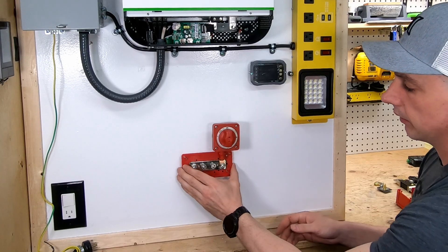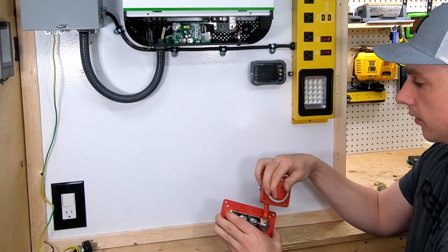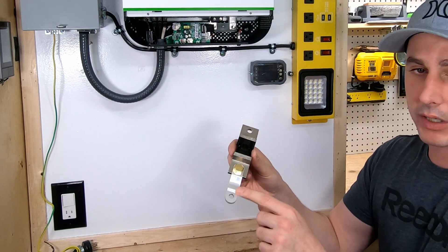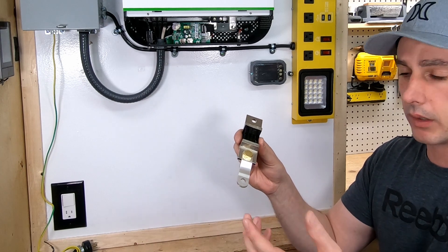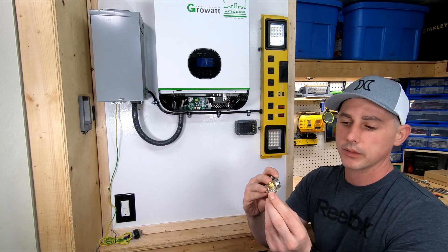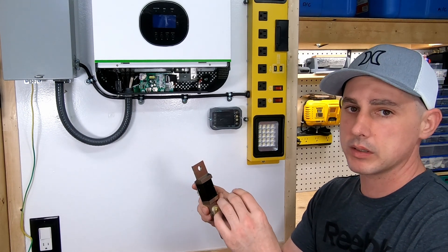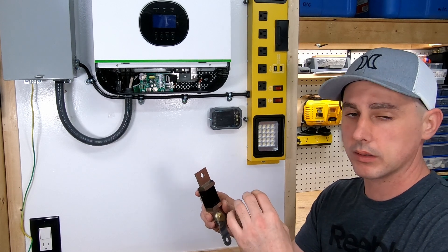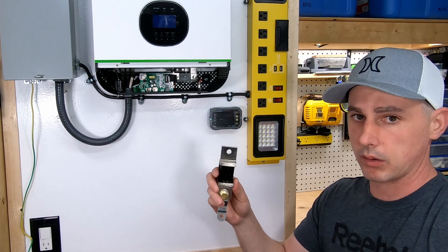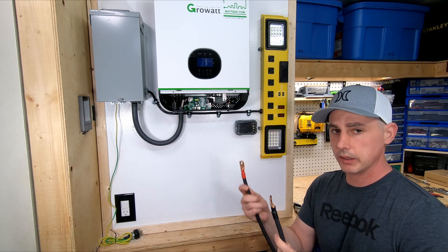This is going to be my main disconnect — it's going to get mounted and I can turn my power on or off for my batteries — and this is my shunt. I've already gone ahead and used some extra bus bars from my raw lithium cells. I always ask the sellers to send me extra bus bars, so here I've just got three of them together. This is going to be coming off my main negative and will allow me to monitor all the batteries across the whole entire system, even though the individual batteries typically have smart shunts and smart BMS's built into them. To mount this up I'm going to dry fit my two cables here into the Growatt.